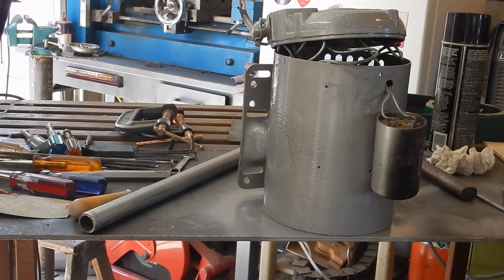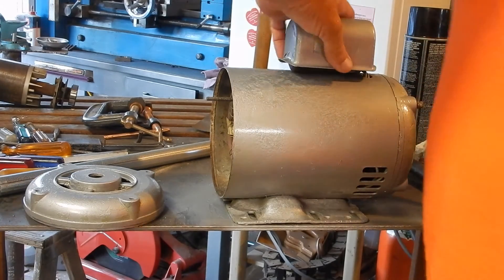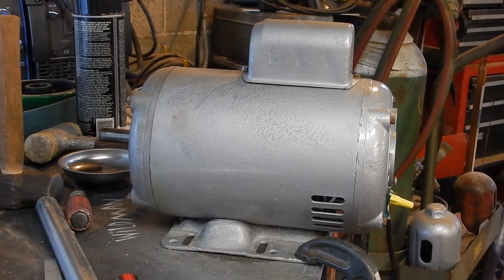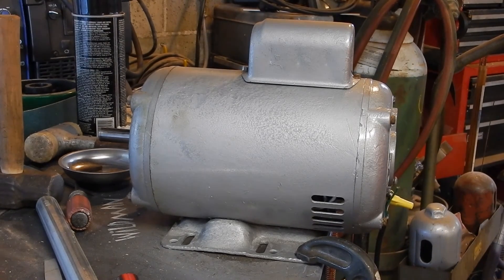While I was waiting for the armature to warm up and dry off, I threw a coat of Hammer Finish Gray on the motor. When all this dries, I'll put it all back together. The paint's dry, the armature's dry — it's time to put it all back together. Brand new bearings, fresh coat of paint, two horsepower — let's see if it works. And it works! That is spinning really nice. Of course, it's not spinning in the right direction to use on my drill press, and I found out that's not changeable. So at least I got a two horsepower motor with brand new bearings that I can use on something else. And that's all for this one — please like, comment, and subscribe.